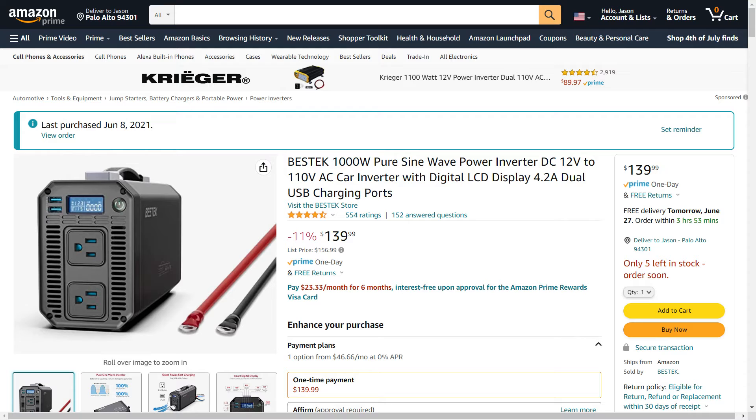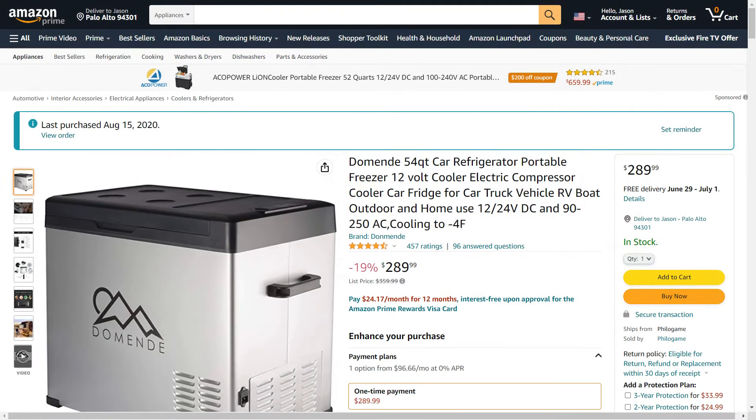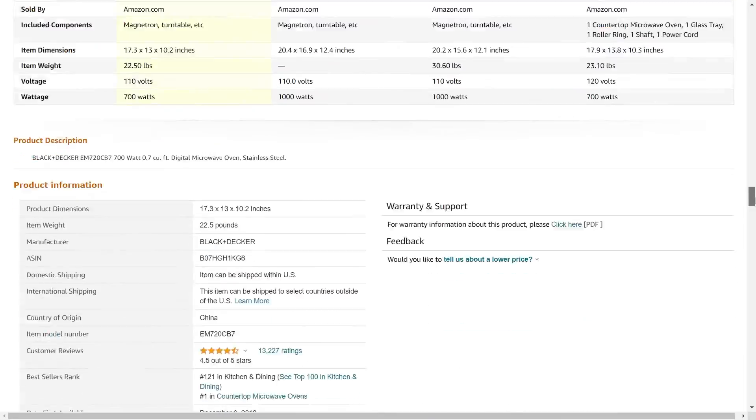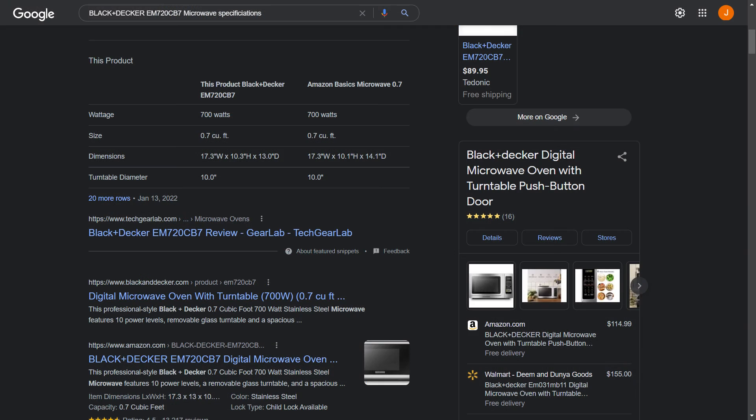Because the power items use can fluctuate, it is always good to have an inverter that has more power than you think you need. I recommend overestimating the amount of power you need by about 50%. Start by determining your present needs by researching the power usage of your devices. For example, I bought my refrigerator and microwave on Amazon, so I looked in the question and answer sections for those products to see what people posted about their power usage. You can also do searches on Google for product specifications to see how many watts an item uses.